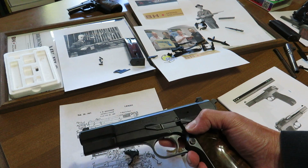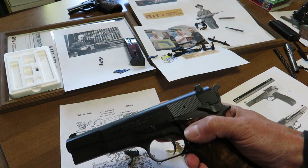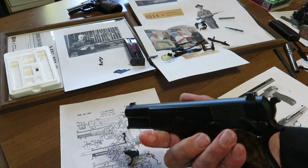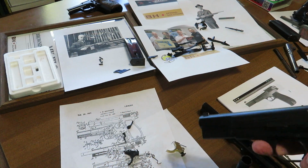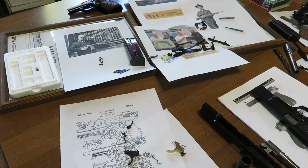John Browning had an automatic, truly an automatic slide stop. Leon Hubert designed the extended slide stop and made it to where you can push it out with the slide forward, just like you see the pistol here. That's not automatic, but that's an easier takedown than was originally designed. So we see Leon going back and sharpening up the high power design and bringing it back, as far as characteristics and components and sort of item per item per item.